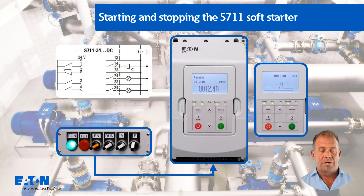When the run command on digital input 1 is cancelled, the soft stop is initiated with a stop time of 15 seconds. The histogram on the right shows, due to the late deceleration setting, that the current only increases at the end.